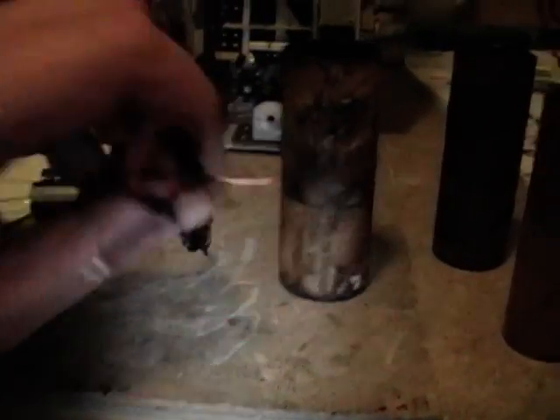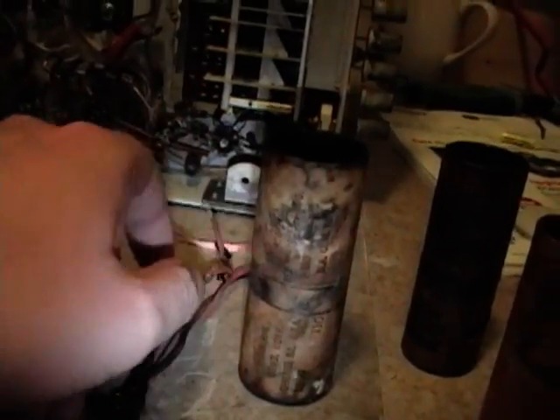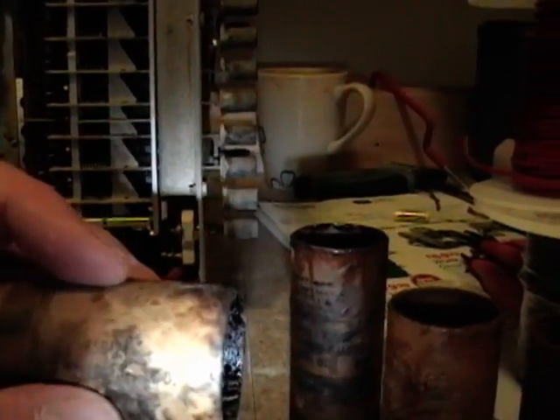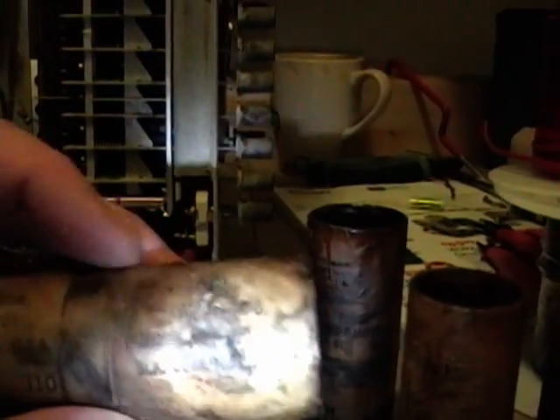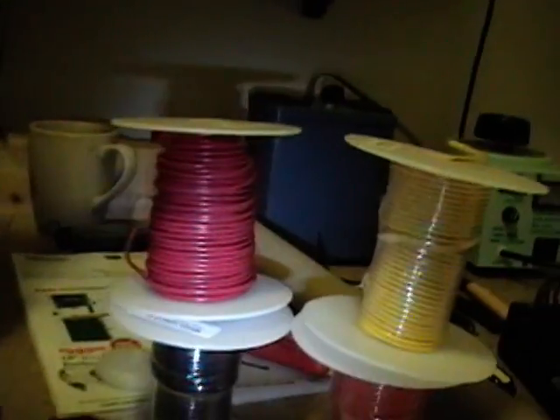Here are the old wires. Because it's two identical sections, they used the red wire for both — so there's a red, a red, and a black. That's why it's nice to retain the old cans if at all possible, because it's really hard to read now, but it says red and it has 100 microfarads, 160 volts, black, comma, negative, and so on.